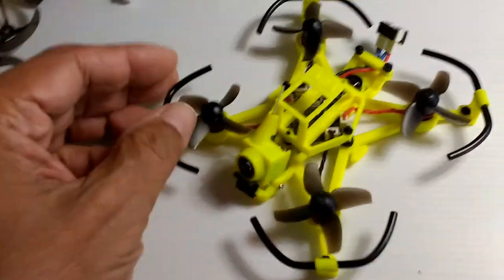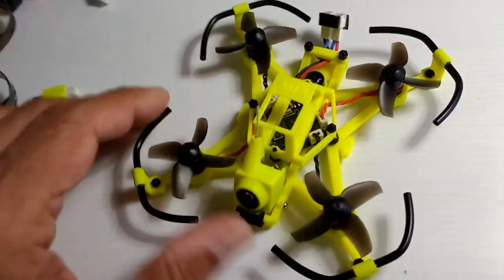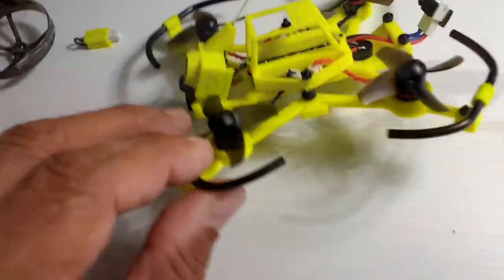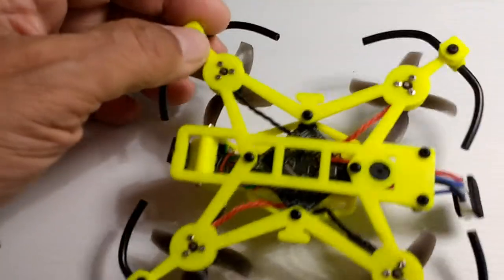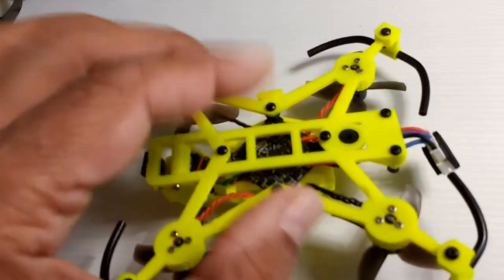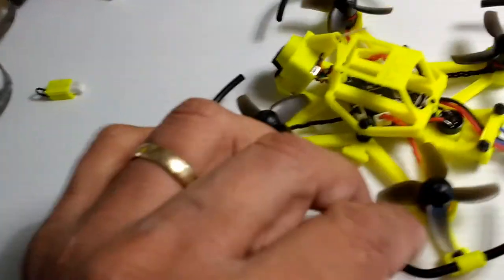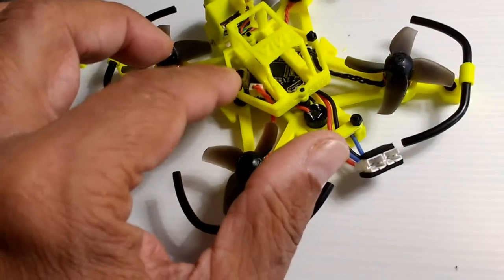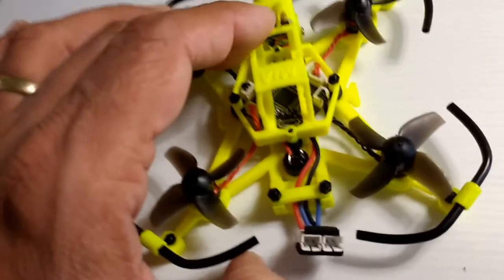They do protect the quadcopters. They are a little bit outside the norm but they do have some benefits and that's the reason why I use them. I was mounting the batteries underneath, and while we're looking at the bottom section here, let me talk about this little pocket here - that's for the beeper. When I designed this frame I wanted to have a beeper pocket there because it just makes more sense to have a socket for the beeper and not have it laying on top of the flight controller board with sticky foam as the stock Mobula 7 is done.